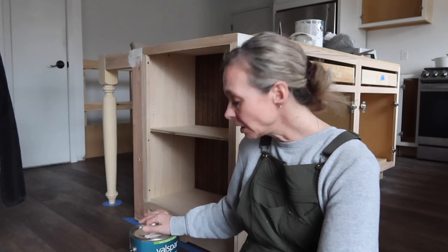Should I have sprayed this before? Probably. But right now, currently, it is February and it is 30 degrees outside, and it's gonna snow. It's not even remotely good enough to spray, so we're not gonna spray. We are going to use cabinet and door rolling. One other caveat is this is wood, and sometimes wood has tannins in it, and so it will bleed through your paint. Now, this is enamel and it's not supposed to have any bleed through, and it has not yet.